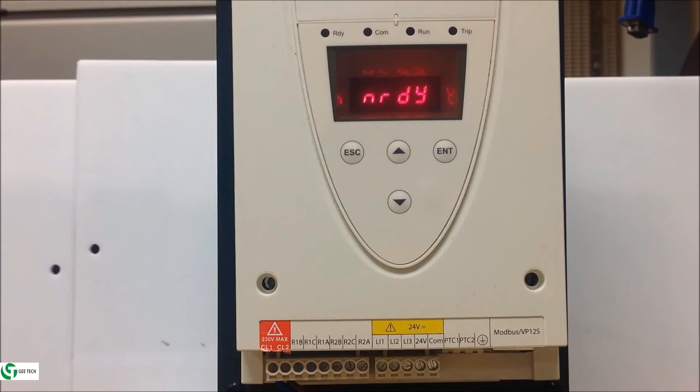And as always with 3-wire, your LI1 is a normally closed stop and LI2 is a normally open push button momentary start. From the factory, this is always programmed as 2-wire, not 3.